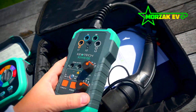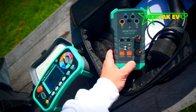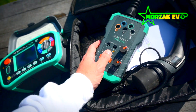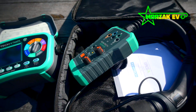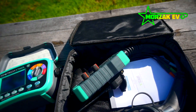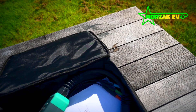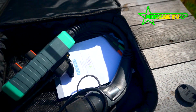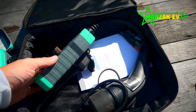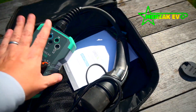So firstly, the EV tester — very pleased with that, works great. Still getting used to a couple of things, but it's got this nice PE pre-test. You put your thumb on the pad and it gives you an indication of if there's any unsafe voltages on the earth. The idea being you use that to determine that everything's safe before you touch anything metallic and start doing all your testing with the EVSE tester and testing unit. That's a really nice feature — just an extra safety measure to make sure you're safe before you start any testing.